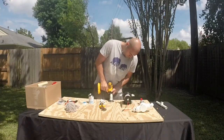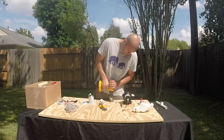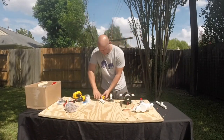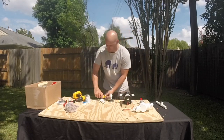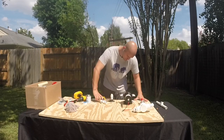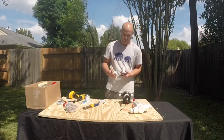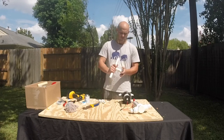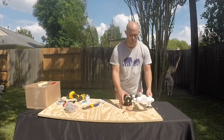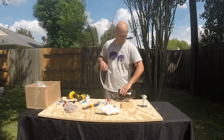I'm hand-tightening these now, and then screwing this to the plywood only to tighten the adapter onto the floor flange. I'll remove it after that and put it in its proper place. The reason I'm doing this is I'm not exactly sure where it's going yet, so I'm just getting it tight, then I'm going to move it over by the Rusco spin-down filter. I know this piece is going somewhere in the area I had just set it down. Once I figure out exactly where it's going to go, I'll screw it to the plywood. What you just saw me do was dry fit the Rusco spin-down filter onto that PVC pipe — I don't want to glue anything until I know exactly where it's going to go.